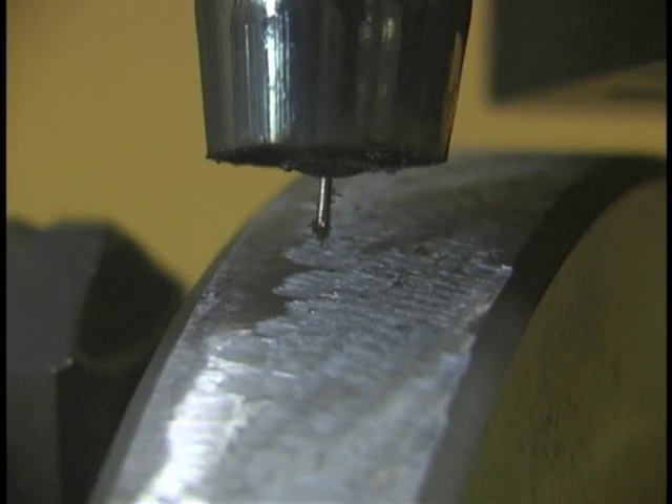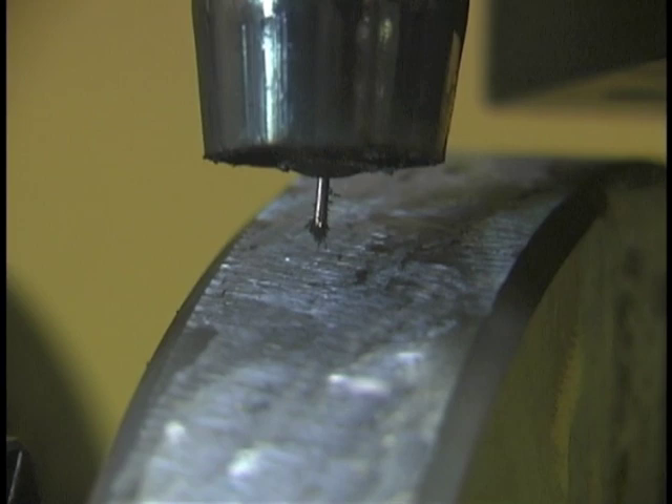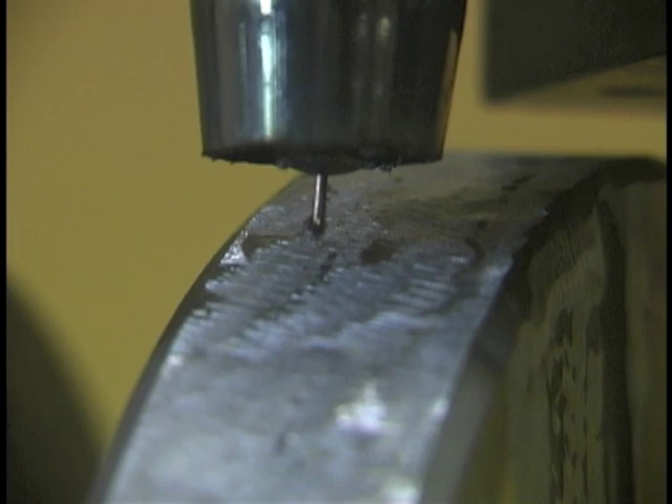I thought about a little demo today. I put a piece of steel on the turntable with a stationary MIG torch so I could gradually adjust the stick out up and down. My turntable's ground is not perfect right now — it needs cleaning up. It has a spring-loaded carbon brush that rubs against the turntable shaft, which is supposed to maintain a consistent ground, but you can tell from the video it's kind of intermittent. I'm going to put this big plate of steel here with a fixed travel rate and torch at a fixed distance that I can raise and lower gradually, and we're going to notice some differences as we lose that ground intermittently with a short stick out versus a long stick out.